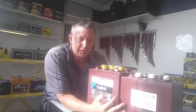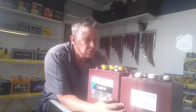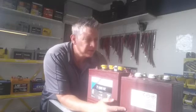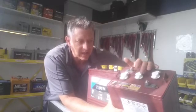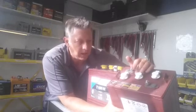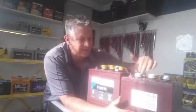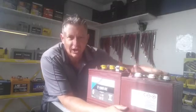Trojans produce these different batteries for different applications. The T105 I have here is what's called the T105 Plus. You may be familiar with just the regular old T105 or the Mileage Master. The T105 Plus Trojan has switched the cap system to a single hinge staggered cap. It also has an indicator inside to not overfill the water. I really like this battery because I've done a lot of installations on boats and RVs and I've had to cable through the battery before over the top, and with the single cap system like the Master Vent, it's a problem because you have to un-cable to check the hydration.